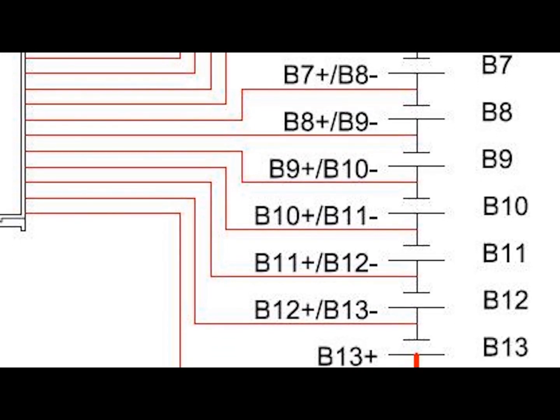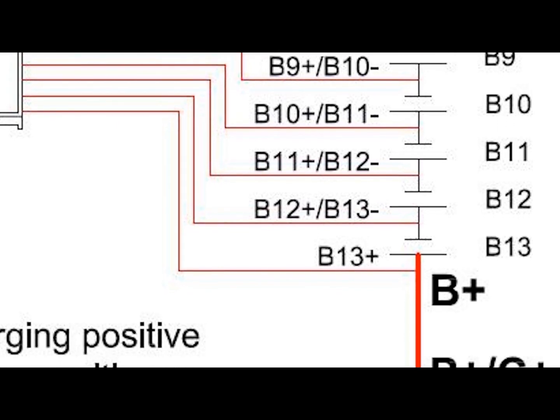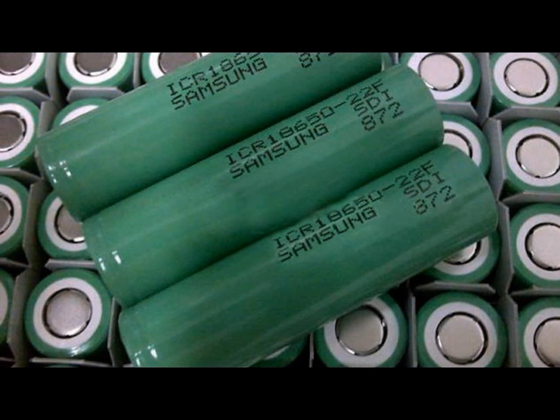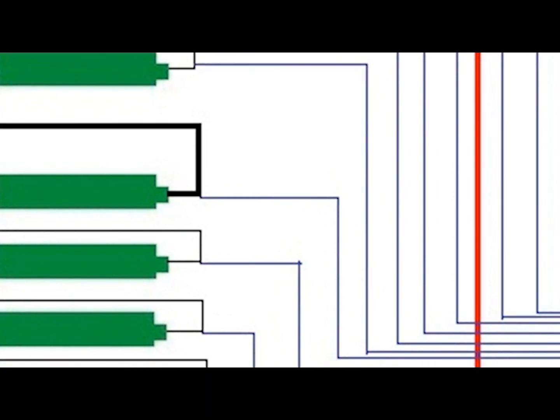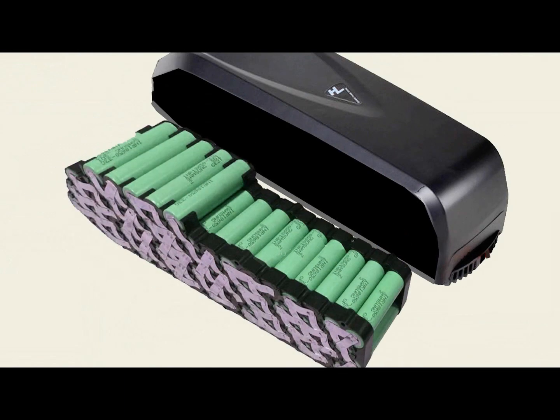The BMS is controlling items such as voltage — total voltage or voltage of individual cells — temperature, average temperature or temperatures of individual cells, state of charge or depth of discharge to indicate the charge level of the battery, state of health — a variously defined measurement of the overall condition of the battery — and the current in or current out of the battery.